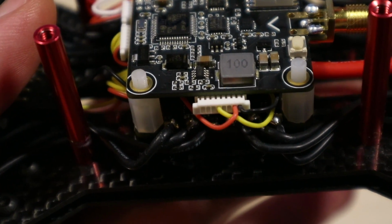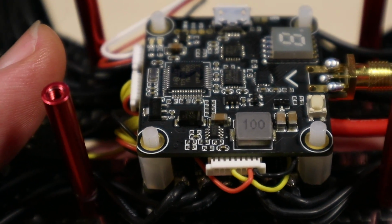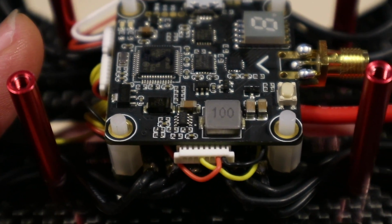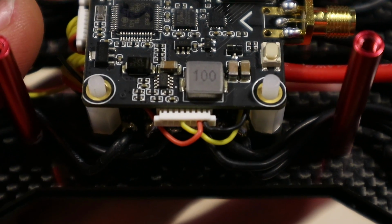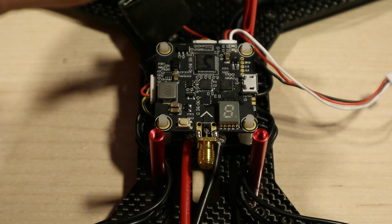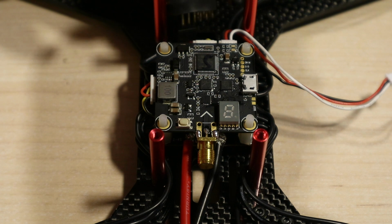Yet what I found, and this is purely by trial and error, is if I set up UART 3 as serial and set it to S-bus, then it would work as S-bus, which was very curious, despite the fact that we've got other ports around here that are labelled as UART 2 and 3, so that's really weird. But yeah, receiver's plugged in on S-bus. This is an X4RSB.